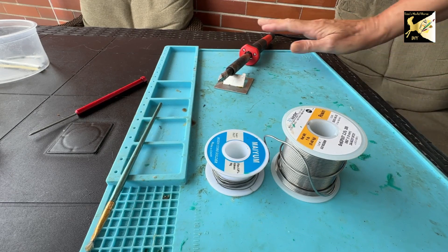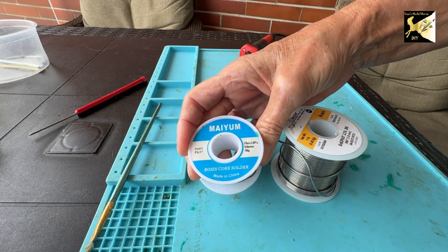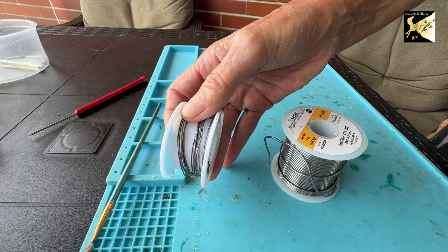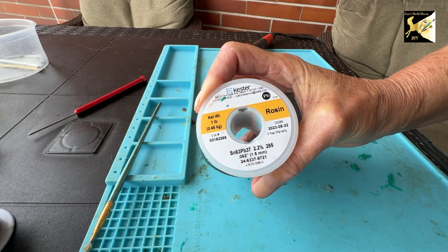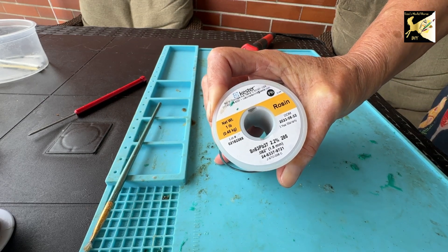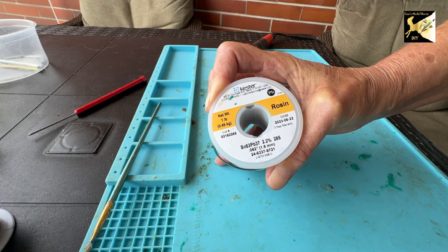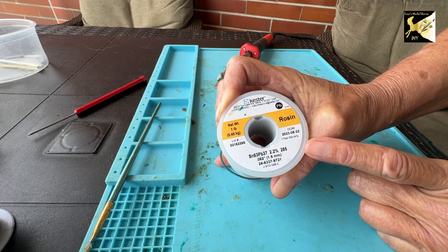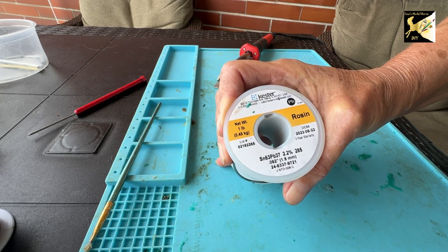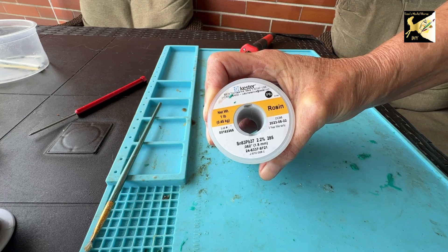I think the second most important thing next to your soldering iron is your solder. I worked for a long time using just regular solder — I used 60/40 and 63/37. They worked, but I went through a lot of it and wasn't very happy with it. So I finally decided to buy some Kester and the difference is incredible. This is a 63/37, which means it will set up quicker than the 60/40 — it doesn't have as much setting time. It has an aggressive 2.2% resin, which I've found works excellent. I like the 1.5 millimeter width — thinner is too thin and thicker just leaves too many lumps.